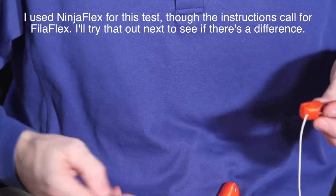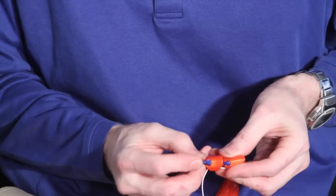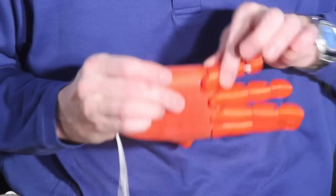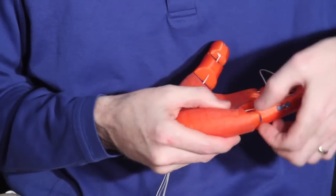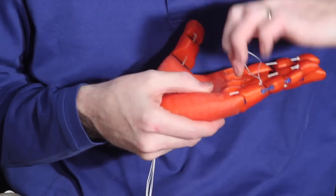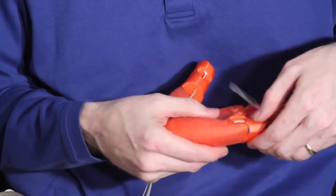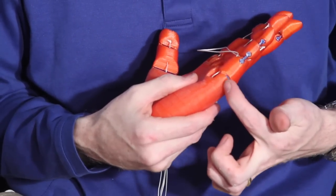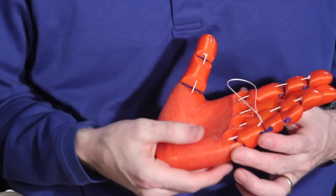The design of the fingers and the way that they slide into the hinges is really nice because it basically just slides into the channel there, which makes it really easy to put in, and then likewise slides into the channel on the next phalange. The challenge is getting the actual base onto that hand — it's not designed to be slid onto it like the others. It has to be pushed onto it, and if you use a flathead screwdriver to sort of cram the hinge into there, it's quite challenging. I think that could be improved maybe by incorporating a slide design — if you left a spot on the side for that to slide in, maybe covering it up afterwards, that might be preferable.